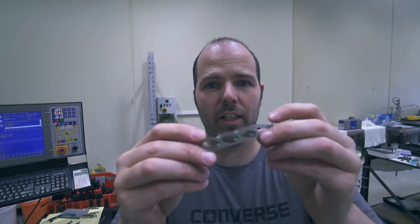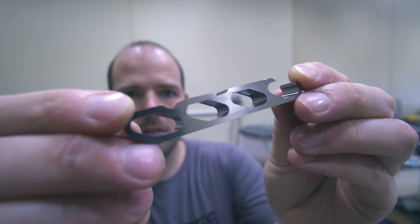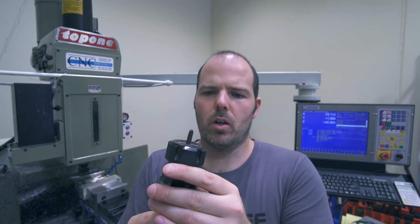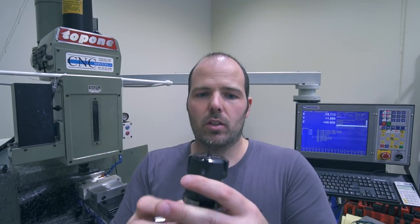Okay, so now we are really getting somewhere. Apart from the little screw up with the outside, the inside seems to have gone pretty well. Now the next bit is where it really finishes the bottle opener. What I've got here is a chamfer bit - I think it's also called a spot drill. Basically, instead of the corner coming down at 90 degrees, it'll put a 45 degree angle on all the edges.